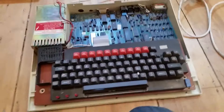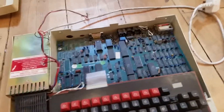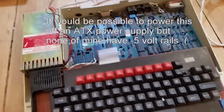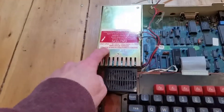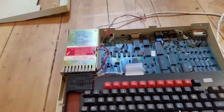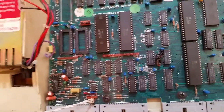I think this all works off 5 volts and ground, so you can power it off an ATX without doing this, but looking at this, a bit of the supply is held with three screws by the look of it. I'll take that out - just a word of warning, this does contain voltages, so I'm going to be careful with it. The keyboard just unbolts there - really clunky, isn't it. The keyboard ribbon just pops out there. Little speaker connection here.